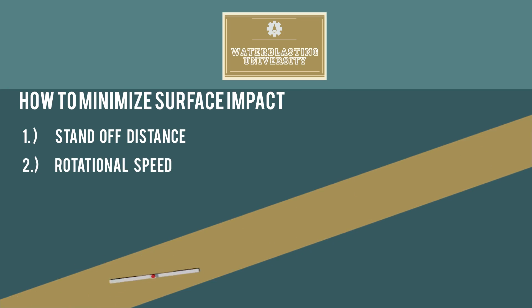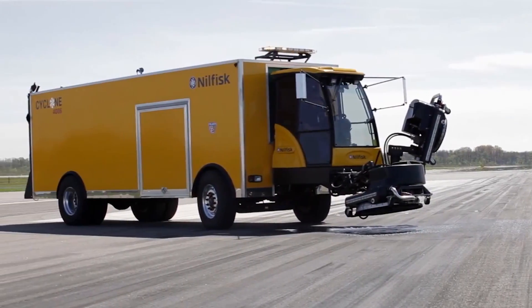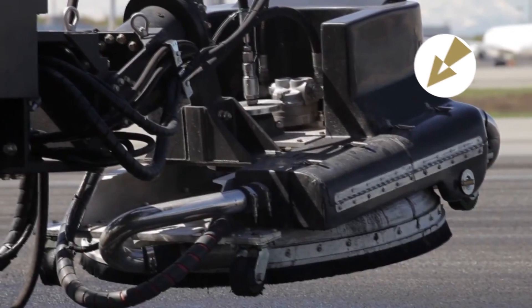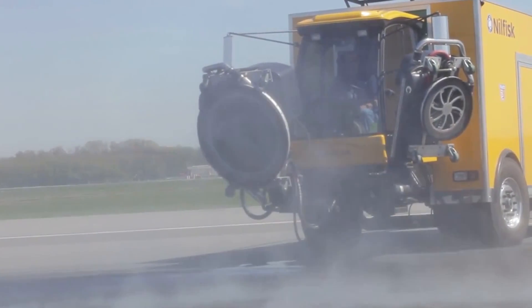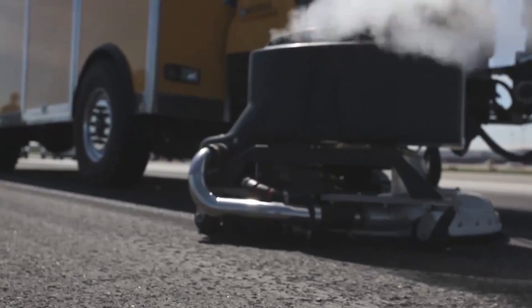Second: rotational speed. Slower speeds result in longer dwell time and a more aggressive pattern, while faster speeds are less aggressive. The Stripe Hog has completely independently adjustable RPMs for each head. This manufacturer attempts to combine a fan that flings the debris into a hopper placed on the side of the head. Doing so makes debris collection dependent on RPMs and completely eliminates the flexibility to adjust the RPMs of your spray head.